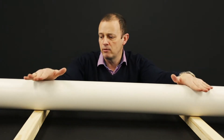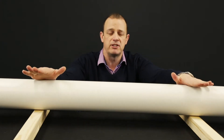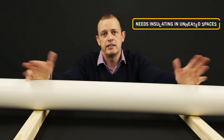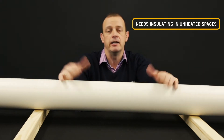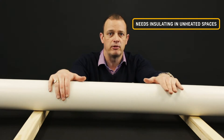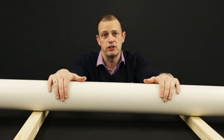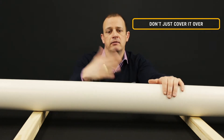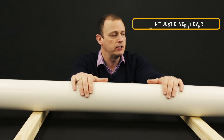That's a lot better to do. The only thing we've then got to look at: most of the time when ducting is running along lengths, especially across joists, it's going to be in an unheated area — i.e. a loft space. If we're running ducting in a loft space, it needs to be insulated properly. There are regulations on this, so we need to be aware. Don't just run it and put something over it — it needs to be properly insulated.